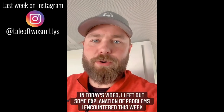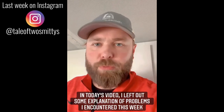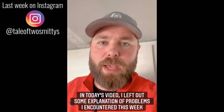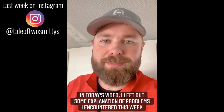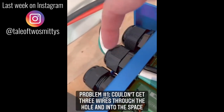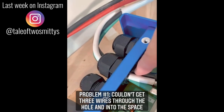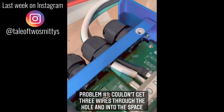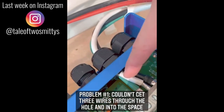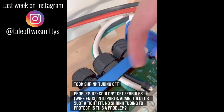All right, so we posted our YouTube video, and when I was going back through it, I realized there's some things that I alluded to, but I didn't really explain that I ran into this past week. So I'm gonna show you some of them now. All right, so bottom of the inverter, problem number one was I had a hard time getting all of the wires inside of here. I initially had shrink tubing on all of these and they just wouldn't fit. So I asked around, somebody said it's just really tight. So I just started shoving harder and harder and took the shrink tubing off eventually and finally got it through. So that was the first part.